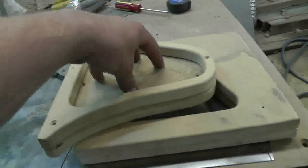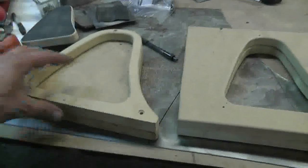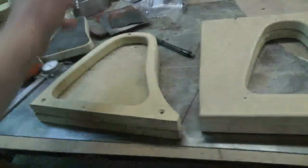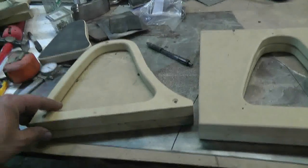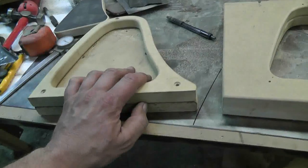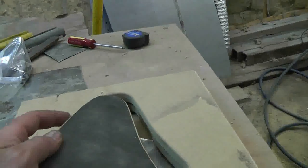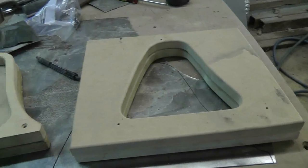None of this works well if I form the flanges on the edge first and then try to form the inner piece. The fallback is I won't bother forming the inner flange and I'll just use a flat piece of metal and shape the edges — which would mean all this has been a big waste of time. But this is useful information to learn about hammer forming and I want to figure out how to do it right. I'll see how it goes — even if I use the press it's not really hammer forming, but I'll try again with the hammer form anyway.